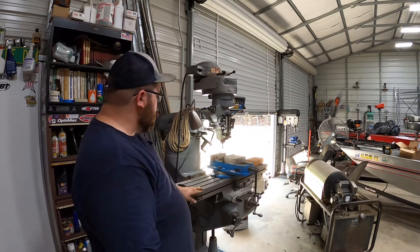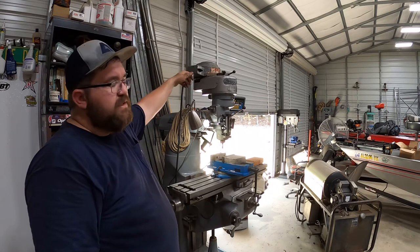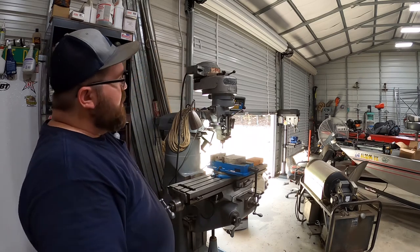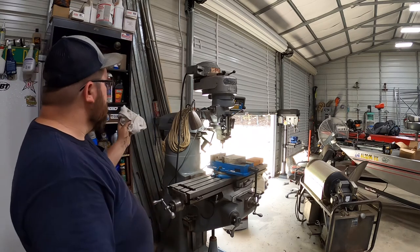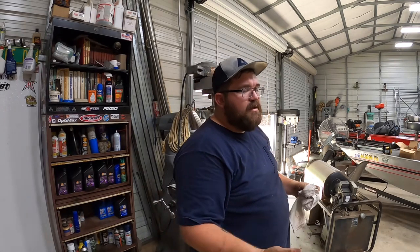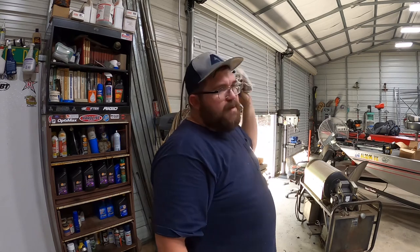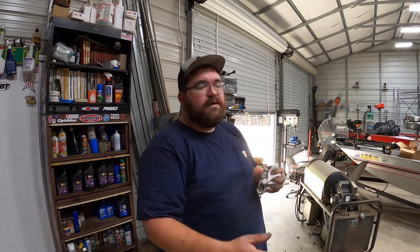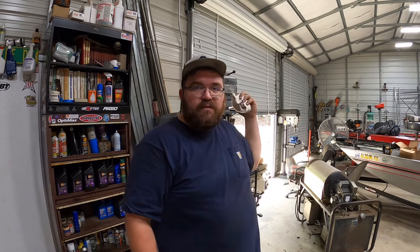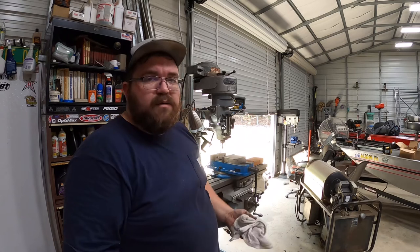Like I said, I hadn't run this machine since I moved it here because I tore up that switch. I went ahead and ran the wire and conduit this winter and I've used the plug for the welder. That's what I did to save a little wire, because wire and building materials are so expensive. I only needed a small wire for my mill, but I needed 220 volts. So I decided to run a bigger wire for my welder instead of running two lines of conduit, two lines of wire. I'm not a conduit bender.